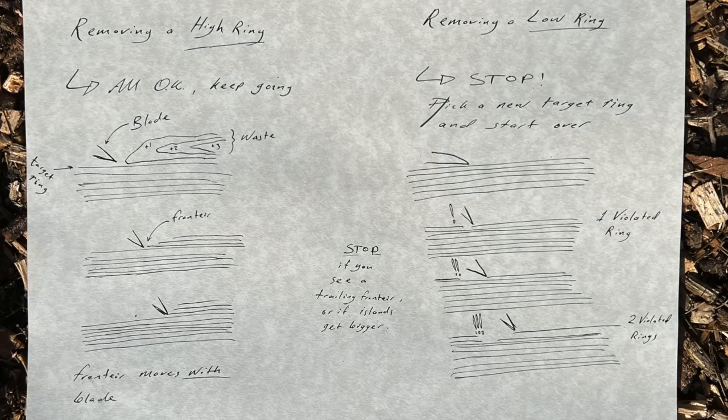One other use case for ring chasing is using the inner splits of belly staves. With a large hickory stave the waste piece may be big enough to make a bow, but splitting will violate the fibers on the outside of the inner stave — so we can rescue it by chasing a growth ring.